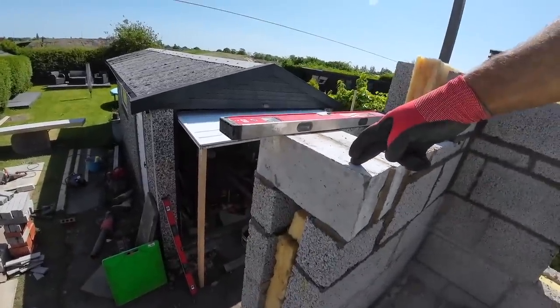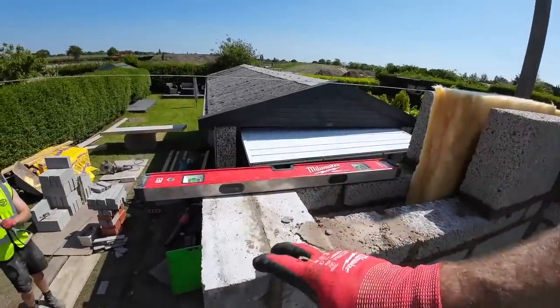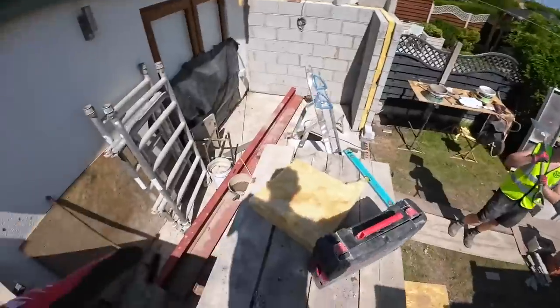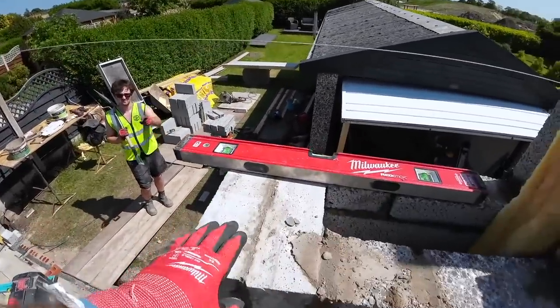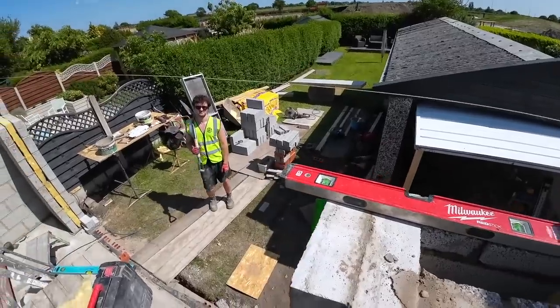So, that's what's going on with the padstones. Bridging the cavity. But because we've only got one, we decided to put the offcut in there. So it's all padstone now. That's full 200. And it's bonding the walls as well. Ready for that to go on top. Same over there, we've got a couple in the garage, haven't we, can bring tomorrow. Yeah, good. So get that one on. We'll slot the bits in the back tomorrow morning before the steel goes on top.